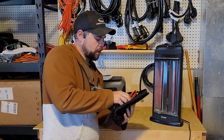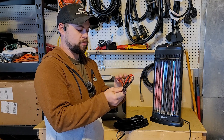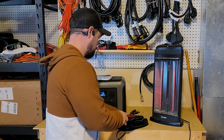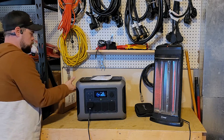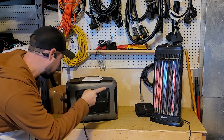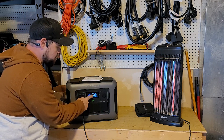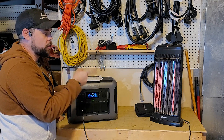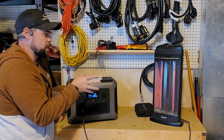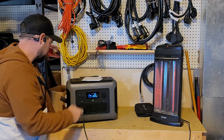This little carry case — let's see what we get. As expected, we have a wall charger and an XT60-to-MC4 adapter, looks like about six feet long. One of the first things I usually like to check is the AC input. So we have — what — a 1000-watt load? It's saying a thousand watts right now, but I know this will generally pull about 1300 watts. There definitely seems to be some sort of difference between the actual draw and what's on the screen.